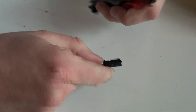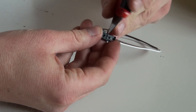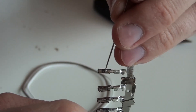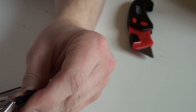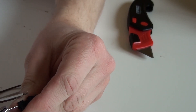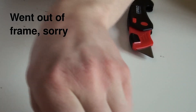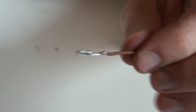When we don't want to use these cables, we just need to open this one. To do it, we need to pop this tab out — okay, it popped out. Now we need to push this tab in on the crimp to allow it to slide out of the housing. What I'm going to do is push a needle inside those flat channels. So I'm going to push this one in. That's the pin out of the connector housing.